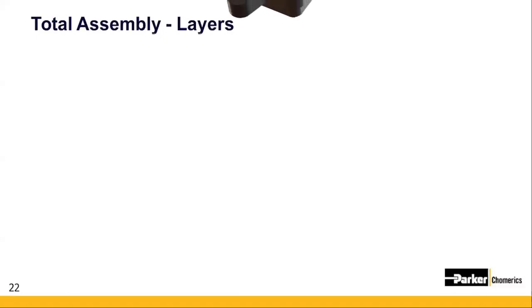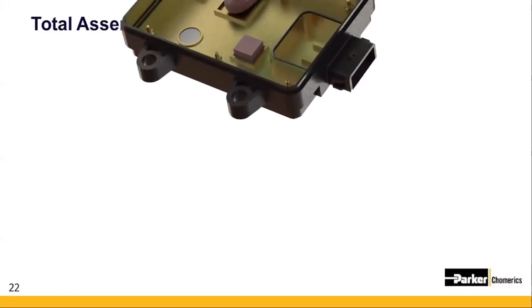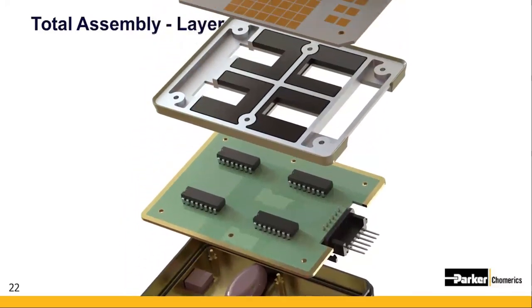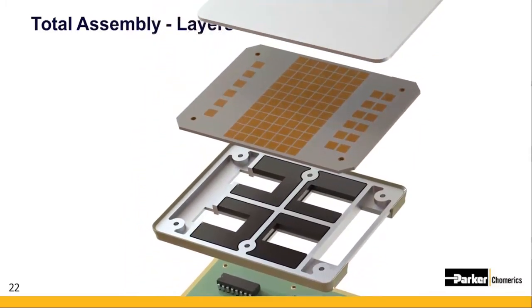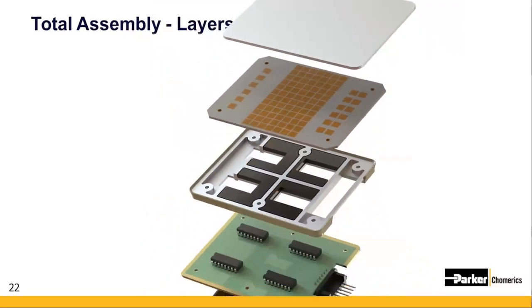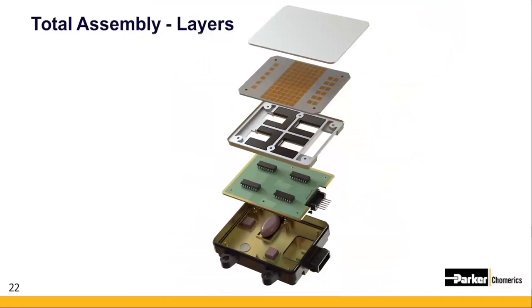The more integration you can provide, the better your opportunity to reduce failure modes. These types of activities are key to your overall goal of zero defects. All of the steps required for both the housing and RF shield can be automated so that each new step is also validating the previous step that it was done correctly and defect-free. This is one of the unseen but substantial benefits that can come from product integration.